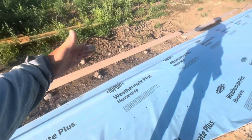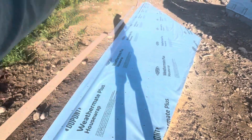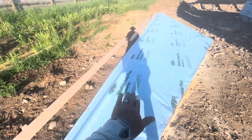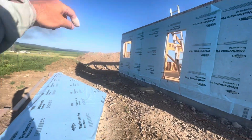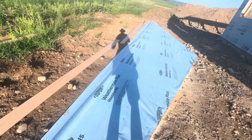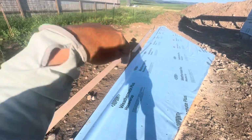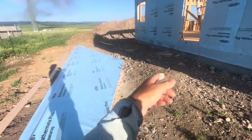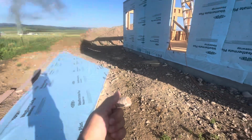We're out here getting these trusses prepped. He'll be here soon. But what we're going to do is take those boards and stand them along the edge, and we're nailing them in, so it has a platform to sit on, and we can nail that truss to the flat edge up there. So standing those 2x6s on edge right underneath the bottom end of the truss and nailing down through all the way across. And then when we swing up, we're just punching a hole in the top here to hook into and lift up.